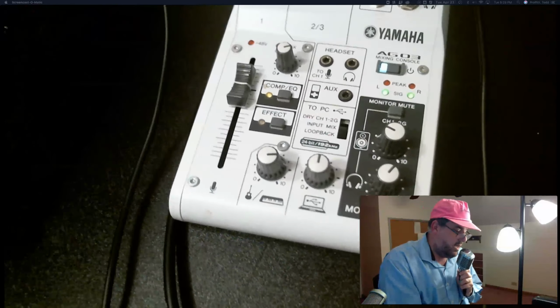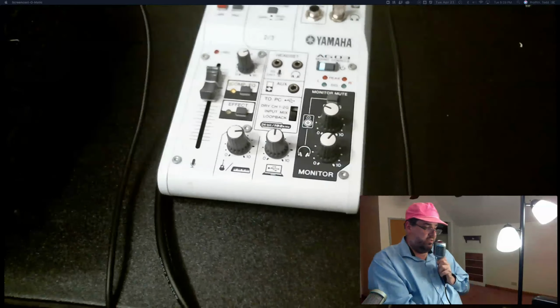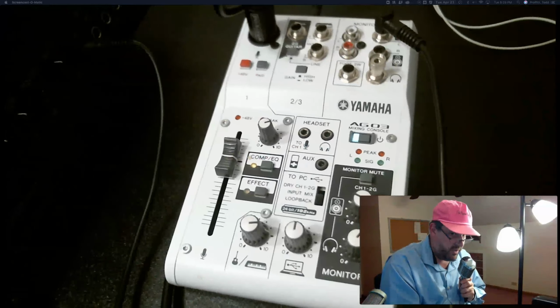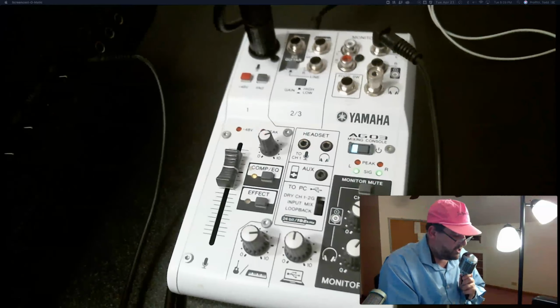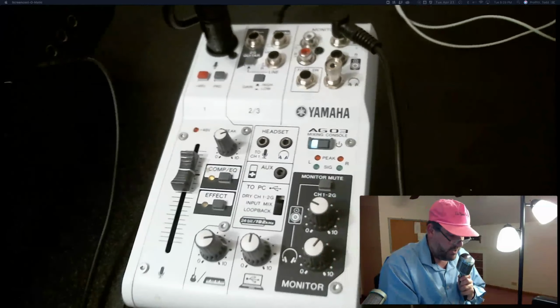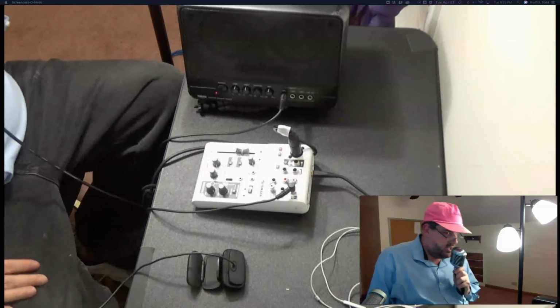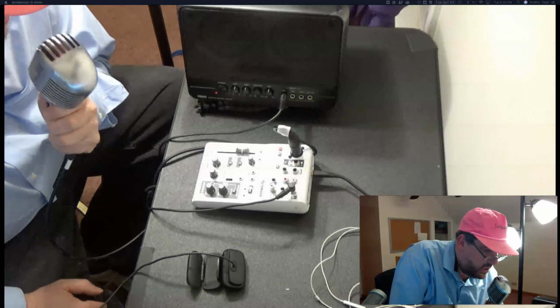All right. Now, one of the things I want to show you real quick is feedback. You'll notice I kept putting this microphone in front of the speaker. If I do that too much, I'm going to get feedback. Now, what is feedback? Let me switch camera views again. Sorry about that. Going black, going dark. There we go. So if I get the speaker too close, it's going to start to ring.